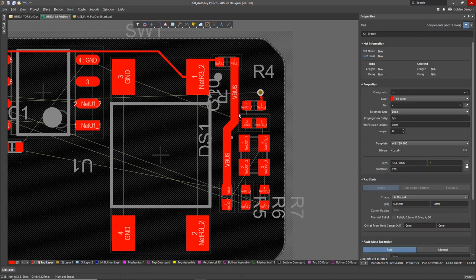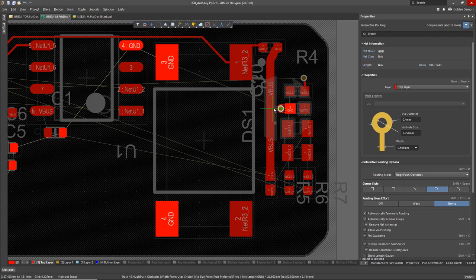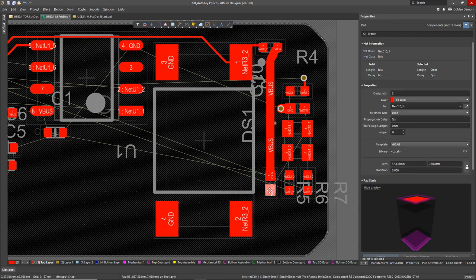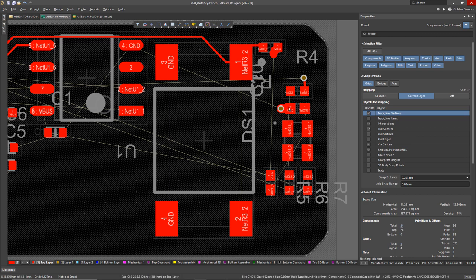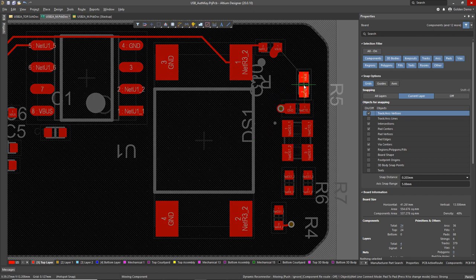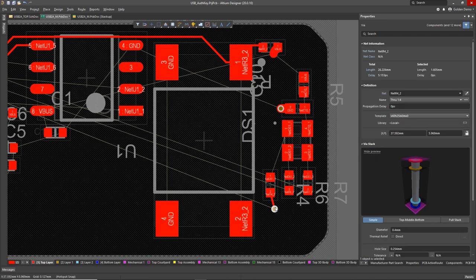Some of these need fanning out. I think I want to swap a couple of resistors — R5 and R4 — over to different positions to make the routing a bit easier. I'll unroute that: select a wire segment and Control+Delete deletes the next segment along. Notice that when I drag resistor R4, it takes its fanout trace and via with it. So even if you fanned out an entire BGA, if you need to just move it a bit it takes those with it — particularly good for small components like decoupling caps and resistors. Let me gloss that and fan these ones out using Route Multi.